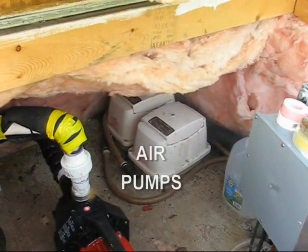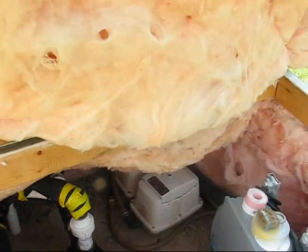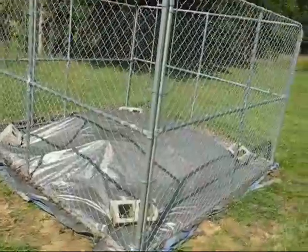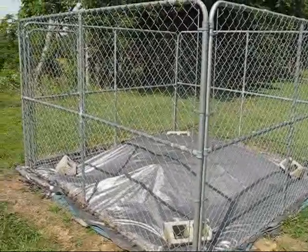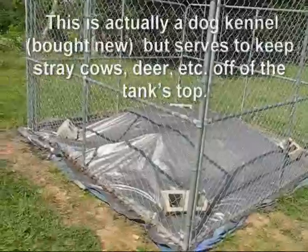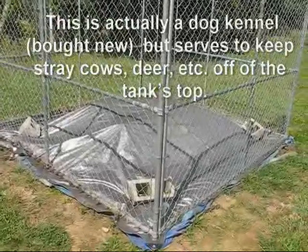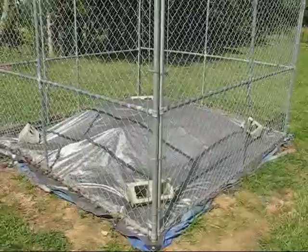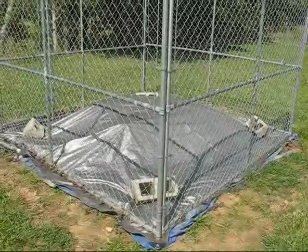If you look back there you'll see two diaphragm pumps — low pressure, high volume, four cubic feet each. They're designed to go with the aeration tank over here. What's underneath that tarp is a tank, about 800 nominal, 1,100 tops. Inside there we have some commercial aeration stones — fishing stones — for pumping air through the water, just like a fishery aeration unit in an aquarium. Except this isn't an aquarium; it's a large plastic poly tank buried in the ground. It's not listed for that purpose, but it was carefully buried — dug by backhoe, buried by hand.